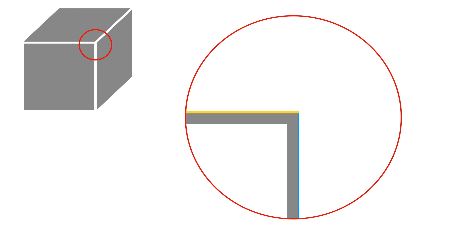There are a couple of ways to do this. Let's say you're making a cube. You can't just select the top and the side to get those cut to size because they'll both occupy the same space in the corner, and occupying the same space at the same time is hella illegal. You can shorten one by the thickness of the other, and this is what I often do with steel — I like this because you get better dimensional accuracy because the sides are all butted up against each other.